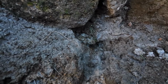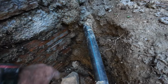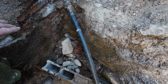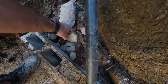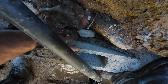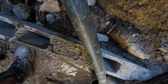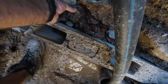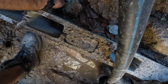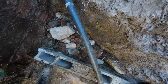So we've still got our troublesome leak, which is coming from here, along here, but no problem. Got the pipe in, not a lot of dampness coming down here. So what I'll do now is just fill this in with concrete and this block, all waterproof concrete. There's a few bits of rubble and stuff in here just to make up the distance, but the whole face of the block work here, I'm going to try and make sure the concrete is in contact with, which, as you can see, because this is waterproof concrete, will be fine. And then we'll make one big step, and then we can build our next block on top of that and make another step.